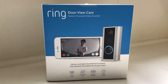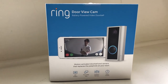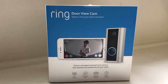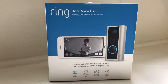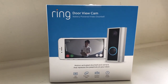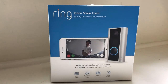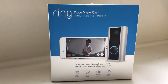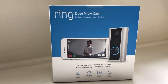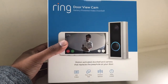If you've seen some of my previous reviews or read some of my previous blogs, you know one of the challenges about having an actual smart doorbell is that it requires a lot more continuous voltage from your doorbell chime itself. And if you have an older home, you might not have enough voltage running, and you run into things like the doorbell current constantly hammering and making noise, or the video feed not even working properly, not even being able to capture enough power to continuously power. One of the issues with Ring, for example, is that if you don't have enough power going to it, the chime actually stops halfway and it doesn't always start filming. So this might be the alternative to that.